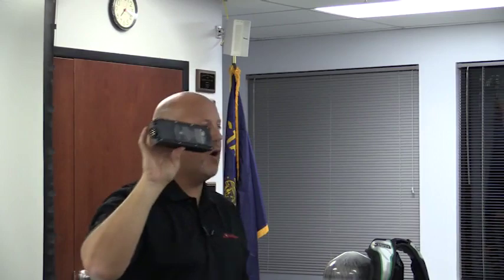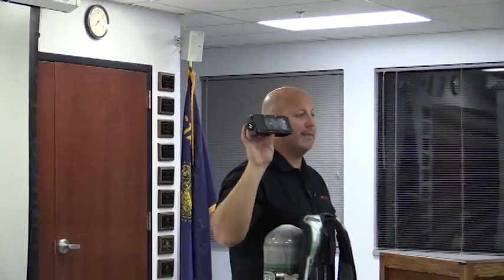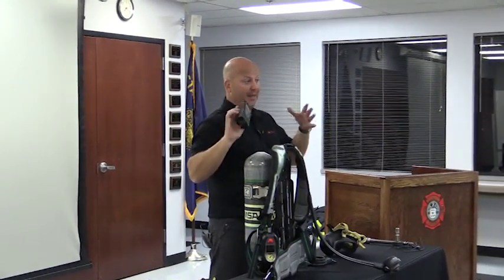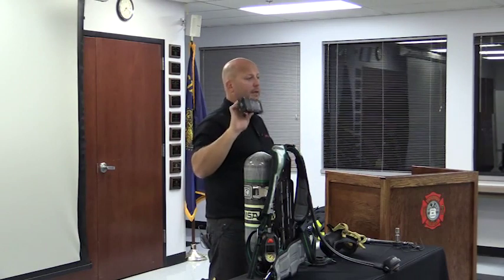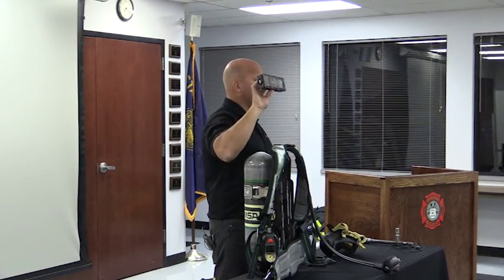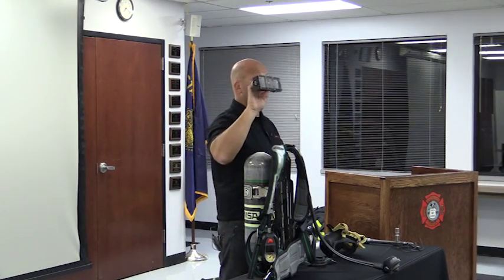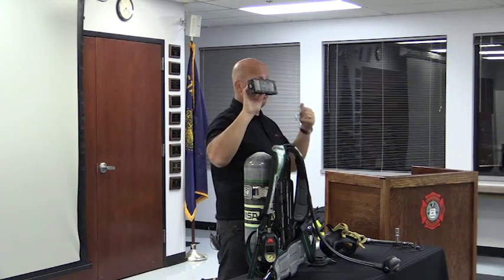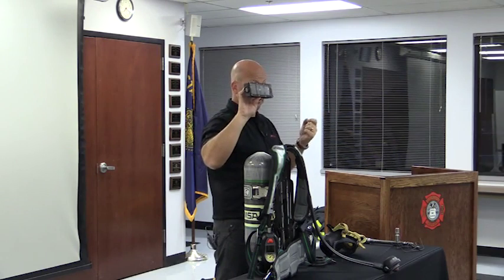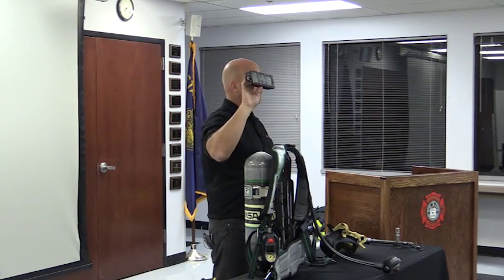Okay. How often are you going to need to replace the batteries? Great question. Don't have an exact answer. The way that your department has configured the SCBA, lights and features and all those type of things, my estimation would be around 6 months. But if you change how the lights are being shown and all that, you obviously could get more, you could get less. Not using the telemetry, not using the Bluetooth, not using things that suck power, is obviously helping you get some battery life.